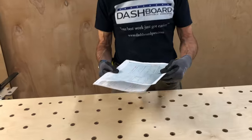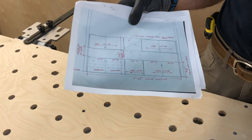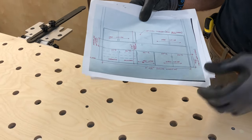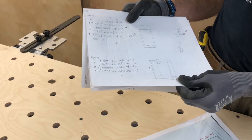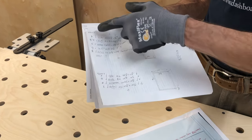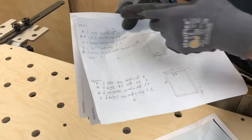I would start off with a drawing like this, just indicating what the cabinets are and their approximate sizes. From that I would know I needed 10 cabinets — 5 bases and 5 uppers. This is not drawn to scale. Then I would generate my own handwritten cut list, deciding what sizes all the parts are — how many I need — and I would give them all letters, so there'd be a certain number of parts for designated letter A and so on down to I in this case.